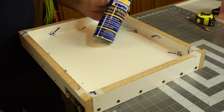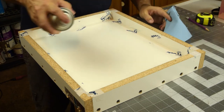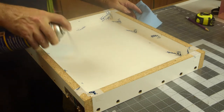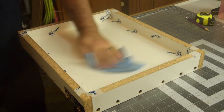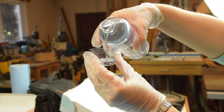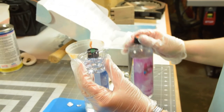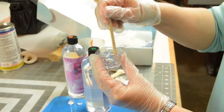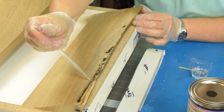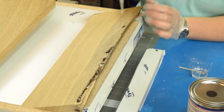Don't forget to use some sort of a mold release. We're using Smooth-On Universal Mold Release. There are probably a lot of products that would work as a release agent — this is just what we have experience with. Spray it on, wipe it back, and maybe apply a second coat as needed. We'll mix a little bit of this two-part epoxy to use as an edge sealer, just filling in some of the wormholes on the sapwood of this white oak. This is on the underside of the project before we flip things over and do the edge seal treatment.